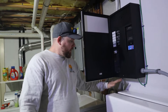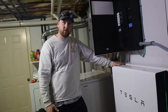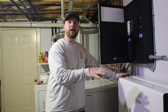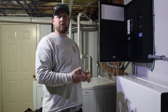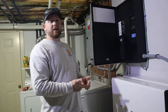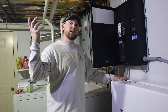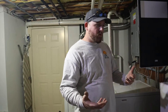With this particular installation, these batteries sit pretty much full most of the time because we also have a program called Connected Solutions through our utility. If you allow the utility to log into your battery bank and export power into the grid during high-demand response events, that allows them to shift renewable energy around in the grid rather than ramping up fossil fuel oil-burning generators during peak demand. It's only limited weeks — typically in our area the end of summer when there are high air conditioning loads. That allows them to leave the battery full. Of course, if the power goes out, the batteries will immediately supply power to the building; if there's sun shining on the modules, the batteries will run the building and the solar will charge the batteries.